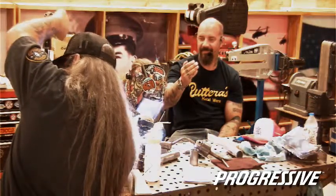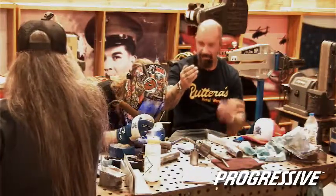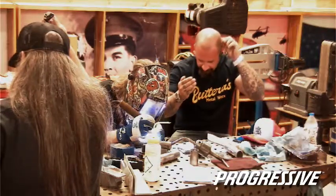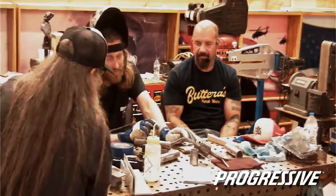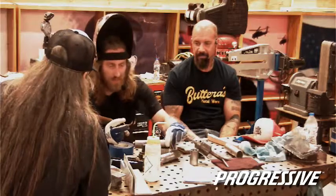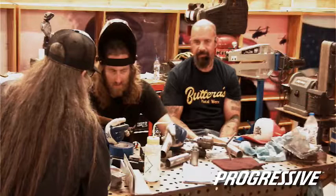So here's an example. Chasing keyholing because it's too much of a gap. But when you pulse your foot, you can kind of catch back up to it and just make sure you get the rod in there. It does put a lot more heat into it, trying to fill the gap. It's possible. But see what it's doing now with the adhesive that's on there.